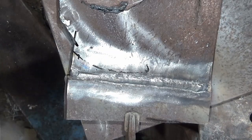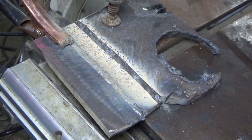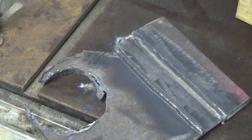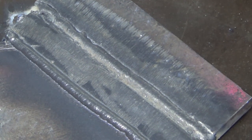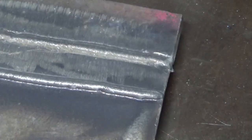Once you've done both sides, give it a hit with a wire wheel and have a look how you did. Study your weld — this tiny bit here was done too fast, then it sat in this spot a little too long. The next couple of inches are really good, then it slows down too much, then speeds up, and this lump here means it sat in that area too long. The point is: keep running the beads, keep practicing, keep doing it until all those beads are the same thickness, the same height, and the same tight grouping. That's 99% of doing a decent weld — having the timing perfect.